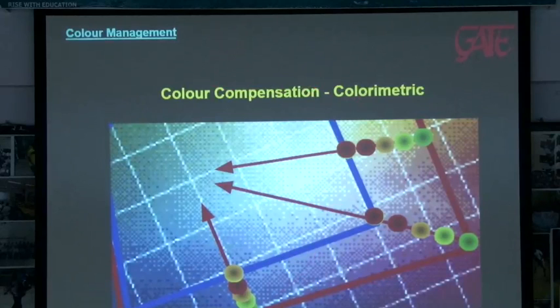And when you do absolute colorimetric, and if you also have digital proofing along with your printing, if you proof that picture or that job on the digital with absolute colorimetric, it also simulates the paper color. So your digital proof doesn't look very white. It will take the color of the paper that you are printing on the machine. If it's mapped like on newsprint, then it will show you that color. So you get better representation in digital printing with this.